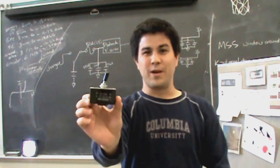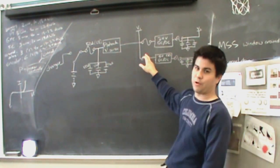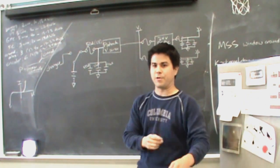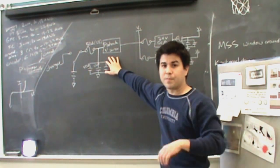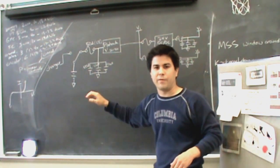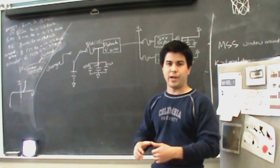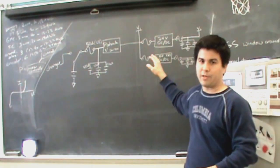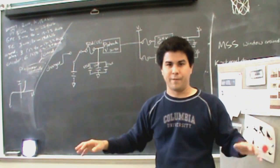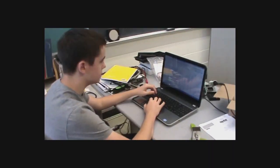This is that switch. Then we have fuses, and there are many fuses throughout this circuit to protect different areas of components. After that, there's a voltage sensor that hooks up to the PIXHawk. As you may remember, we have the PIXHawk, which does most of the flight processing, and then the Arduino, which handles most of the sensors. And from there, we feed into 3 different rails. That all gets linked to different stuff, different valves, the microcontrollers or sensors or whatever needs that power.